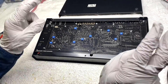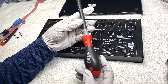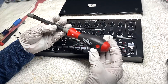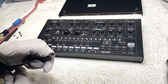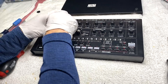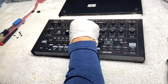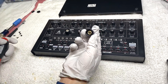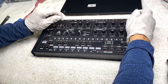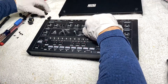If you want to do it the correct way, you'll need to remove the whole PCB stack assembly from the enclosure. You're going to need a 10 millimeter low-profile nut driver — this is a Wiha model 372. You need a low-profile head because you'll need to remove the cap clips and the driver has to fit in there. Hold the knob, loosen the collet nut on top, and you'll end up with your collet knob. Once you remove all 16 knobs, you'll have 16 panel nuts.